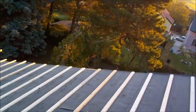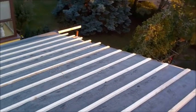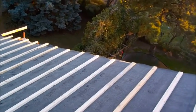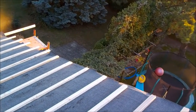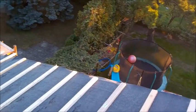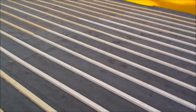The boards that I put on underneath these lats, I've brought most of them this way. I've staggered them a bit to help support this end, because from about here there's nothing supporting that. The way he did it was just terrible. But now I've staggered the boards right through to here, this point, and they're holding that up, so that should be okay. So I am ready for a beer and a bath. We've had two very hard days now.